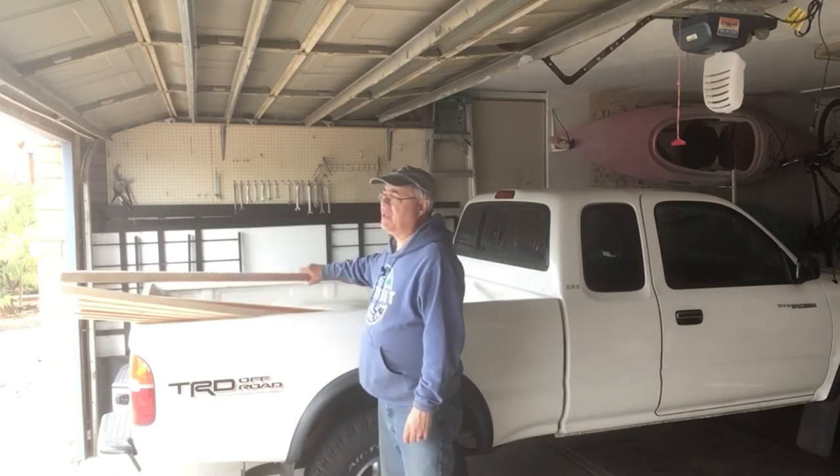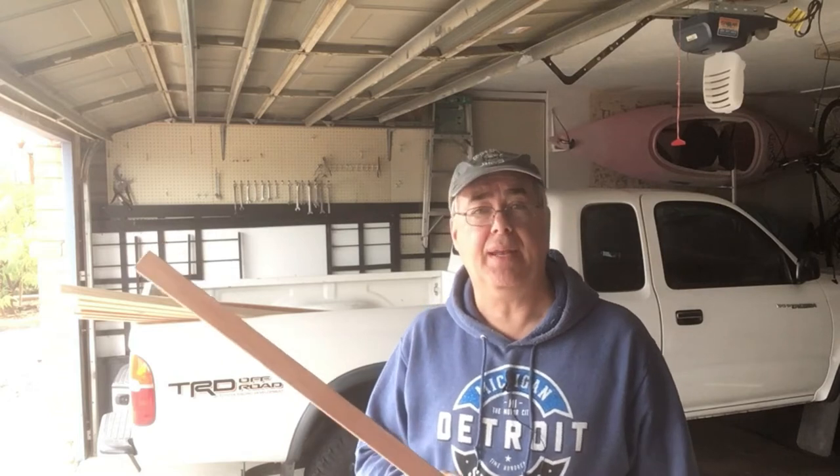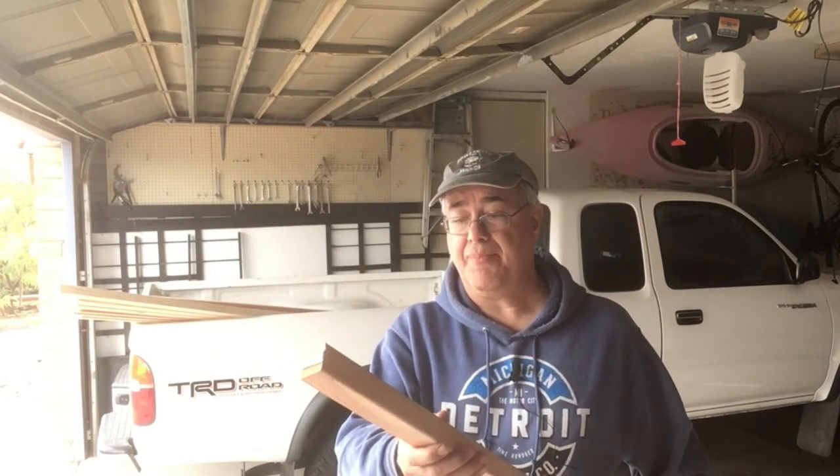I was having a hard time deciding which wood to go with. I was choosing between pine or redwood. At the store I saw wood lath already cut close to the size we need, but it was a little skinnier and the quality wasn't good. The pine was full of knots and heavy. So I went with this redwood — the pieces are nice and straight, sanded on every side, no knots. That straightness, cleanliness, and light weight helped me choose redwood.